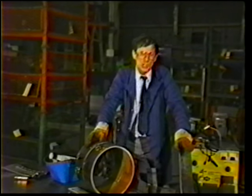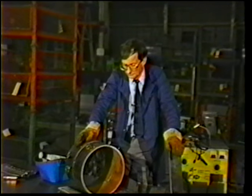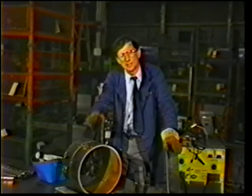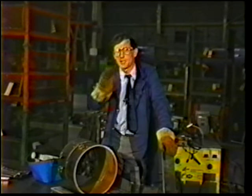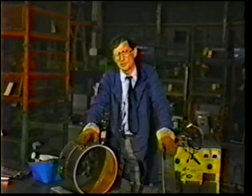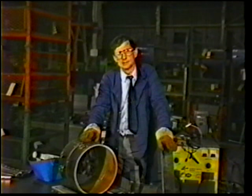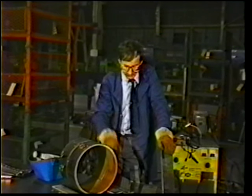You know, so far we've talked about the basic requirements for short circuiting. Voltage around 17, 18, wire feed around the 10, 11 o'clock position, or you could even start it off in the middle, as long as you're in the range. Let's look at some real applications with one objective in mind. We don't want spatter, and we want to do all these applications on one simple setting.